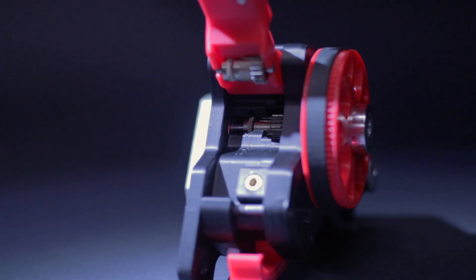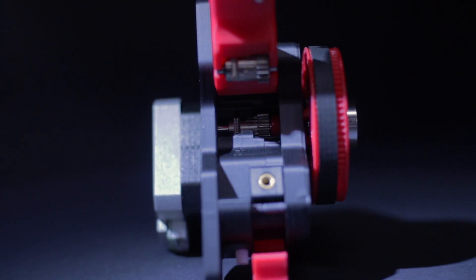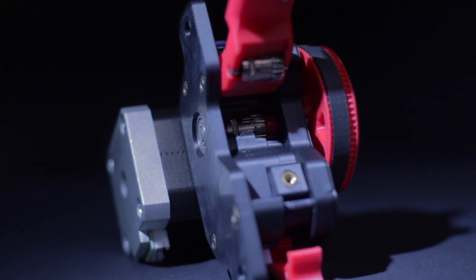This guy is actually interesting. It is an amalgamation of all of the extruders I just mentioned. The belt tensioning system is from the belted extruder. The drive core is from Mobius III, and the latch and unlatch system is from Clockwork. It also uses about half the filament of Mobius III, and it's overall just a much simpler and easier to build design. The latch — it's awesome. I like it.